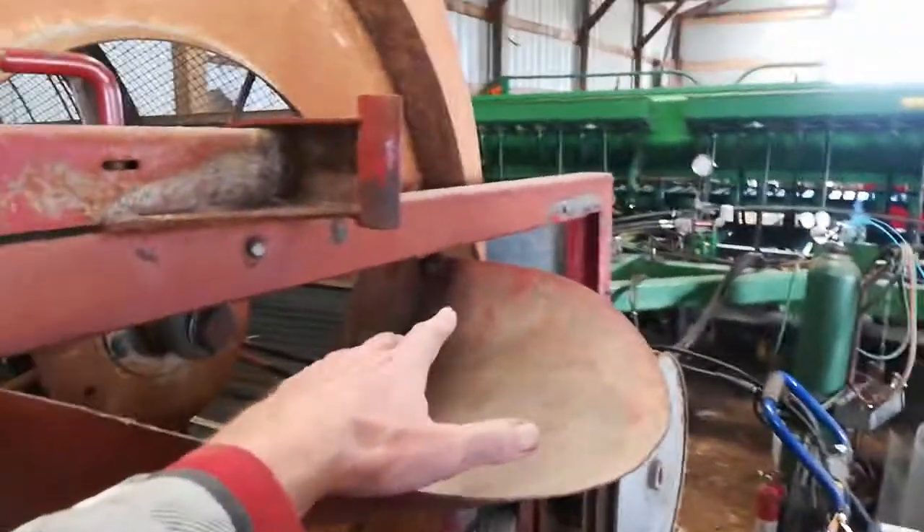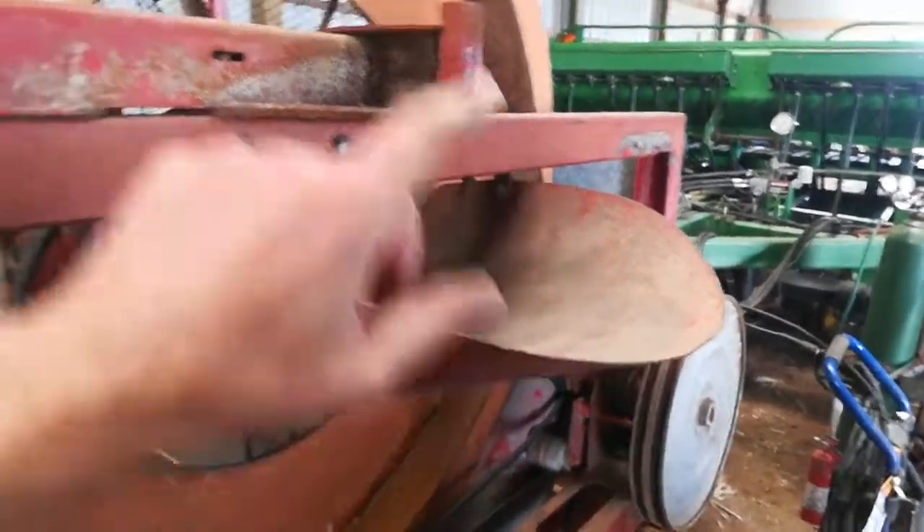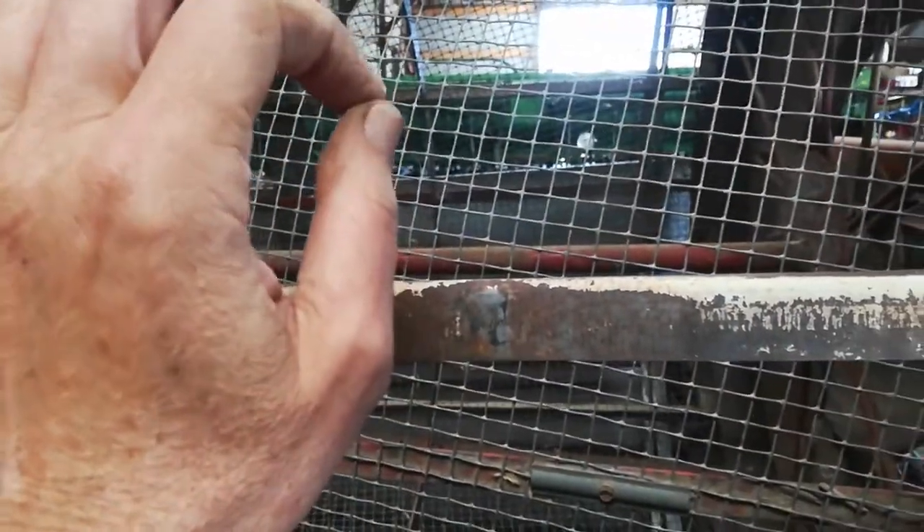I want to make a short video before I started working on this thing. This is a rotary grain cleaner. Dirty grain — in my case it's gonna have weed seeds — gets dumped in here. The inner cone has three-quarter inch squares on it, and this outer one is a quarter inch — I'm gonna change that to five per inch, so 200 thousandths square. The soybeans will fall through the inner cone, get captured by the outer cone, and then get dumped out the back into a hopper. This spins at around 30 RPM.